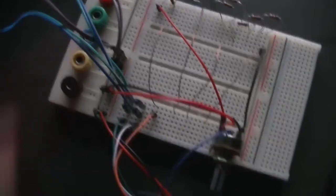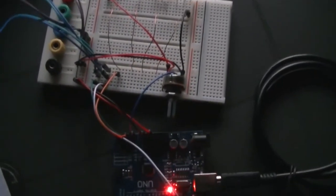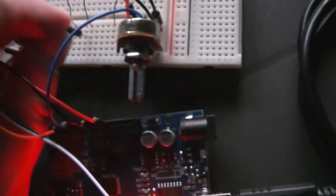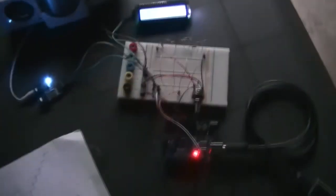That's it — I just thought I'd give you the update on what the score is. It needs tidying up, the code needs optimizing, and it needs mounting in a box. This needs to be removed and replaced with a circuit board with the resistors permanently fixed. This is just a simple potential divider that sends a voltage to an analog input on the Arduino, and based on that input is whether or not the program executes the triangle, forward sawtooth, reverse sawtooth, or random. I can change it back to reverse sawtooth — and there you go, that's it. Any more updates and I'll let you know.